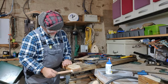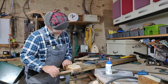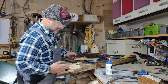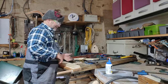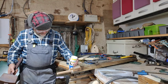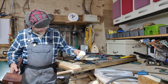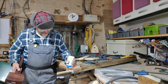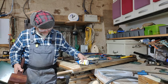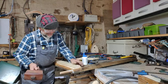It's quite tight in places — all right, it's going in. It's a bit of an angle, that's what happens when you use a bit that long, it went all over the place. But that won't matter — I'm going to put two of these in anyway. Make sure we have enough glue all the way around. The flats allow the glue to travel past the shaft, past your wood, and that way it won't hydraulic. Like I say, it is a bodge, but this goes right up to there.